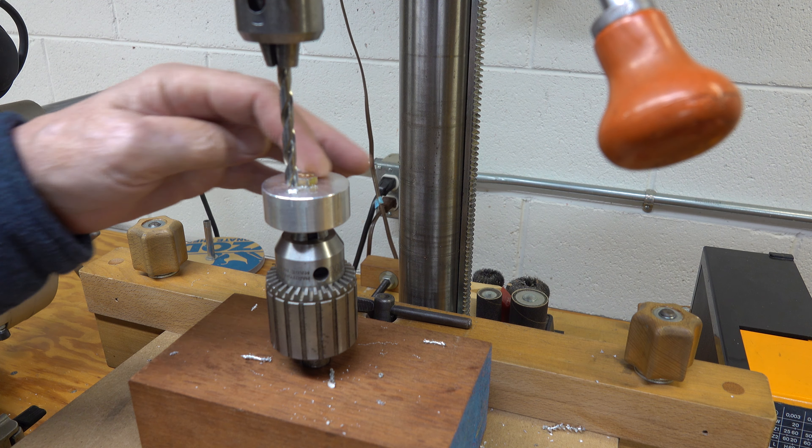Maybe a long half-inch transfer punch or something that's radially round and true. Clamp that in your chuck and you can align the chuck below based on that — let's call it a big drill bit or a big piece of steel that you have in here. Get this aligned perfectly with it, then clamp or screw it down so it's exactly center to center.